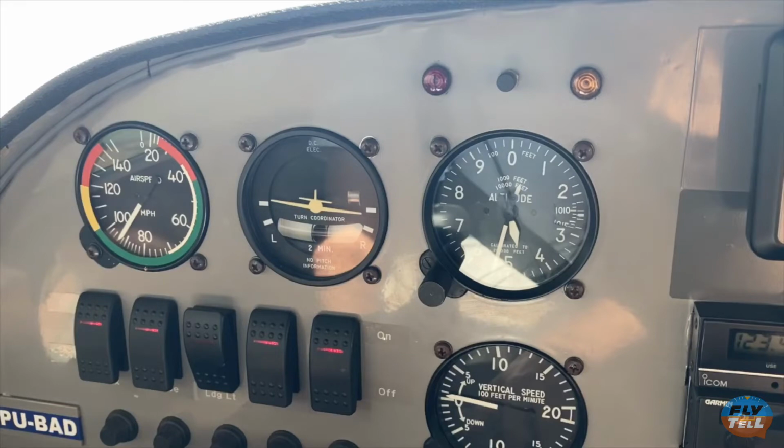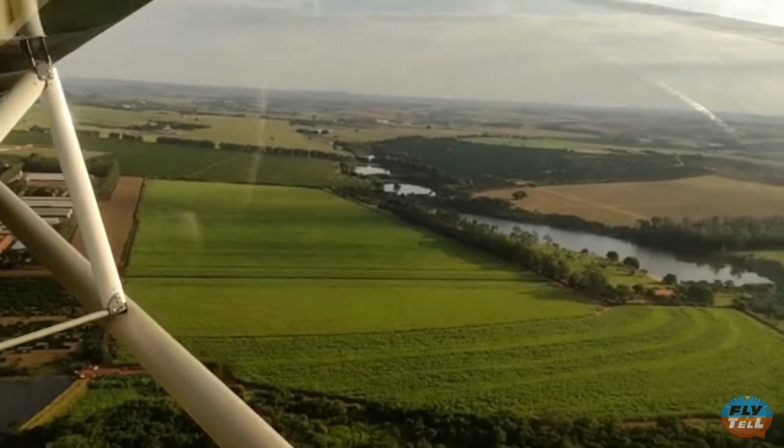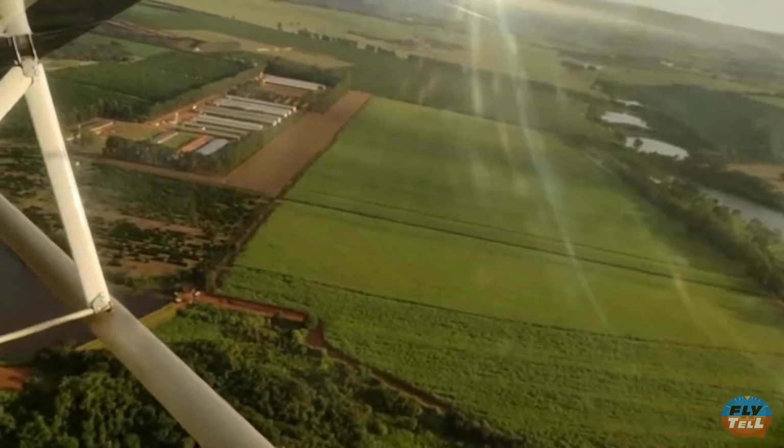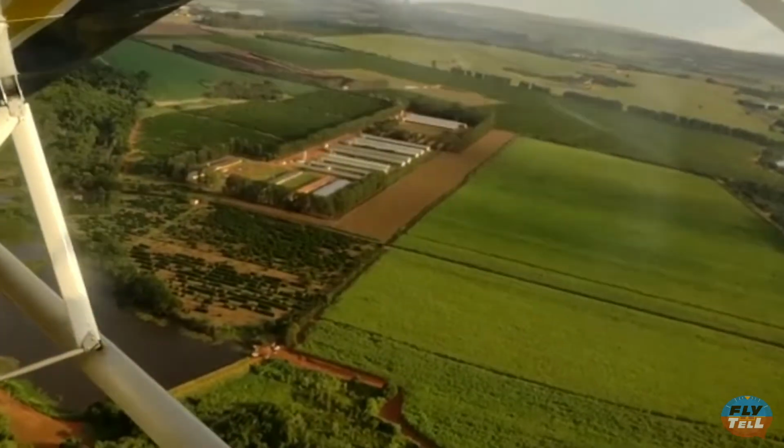We were indicating 94 miles per hour at 4,500 feet with a QNH of 1011 hPa or 29.85 inches of mercury, and a temperature at that altitude of 26 Celsius, 79 Fahrenheit. The E6B says we were true airspeed at 104 mph, or 90 knots. That while burning 15 liters an hour, 3.9 gallons an hour. Not the fastest, but who flies a Coyote to go fast?